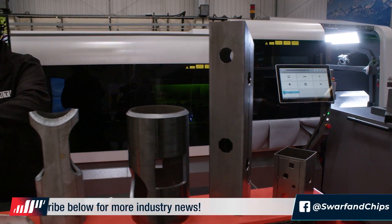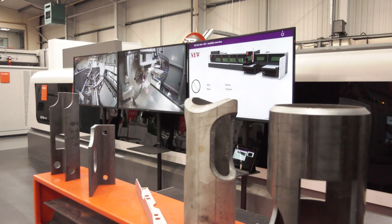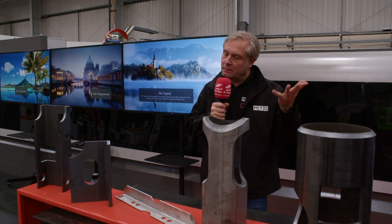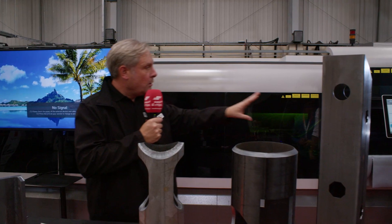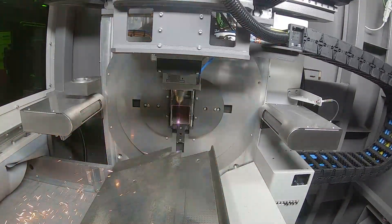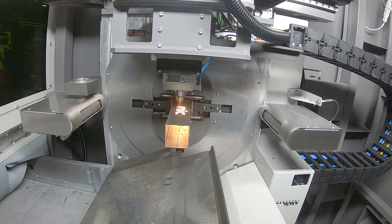You can see the different profiles: L-shape, V, circular, square. The thicknesses — this will cut 10mm up to 130mm in diameter. The actual laser itself is 2 kilowatt or 3 kilowatt. It's obviously a fibre laser, but because you only cut through one side, you don't want to go all the way through and cut the other side — that's why they're not as powerful. They've got laser scan, which accounts for the fact that no tube is perfectly straight, maintaining cutting accuracy. And something unique to this machine is a quick cut system, where the laser moves on the X-axis to ensure either more speed or more accuracy.